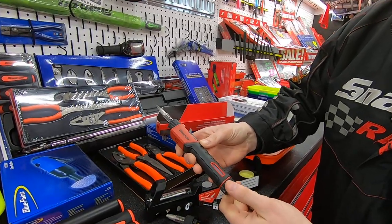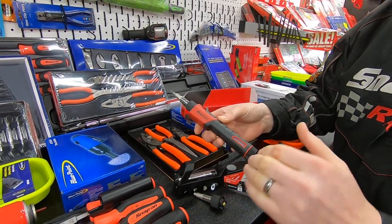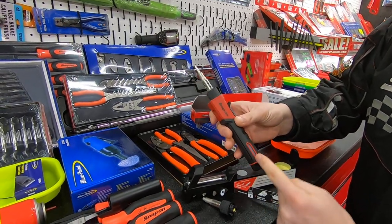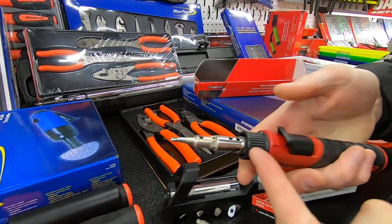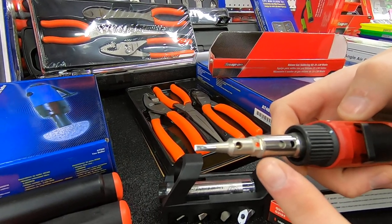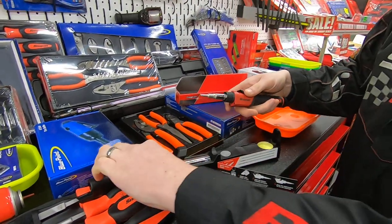Lighting the tool is very easy. You've got full control of the gas flow here, so it's equivalent to 25 watts at the bottom end and 130 watts at the top — so it's got plenty of grunt. There's a fuel gauge on the side so you can see exactly how much gas you've got in. It uses a piezo igniter, so press it forward and you can hear the gas. I've pressed it all the way to the end, the igniter has clicked, and you can see it's red straight away. Give it about 30 to 40 seconds and that will be up to temperature and ready to solder.